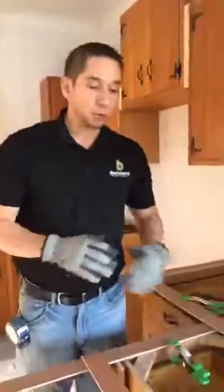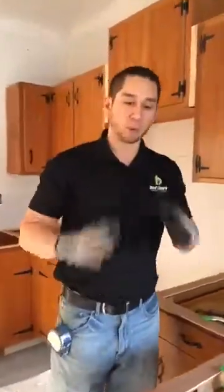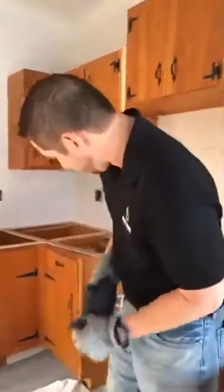Yes, Amy. Something that is very important that a lot of people don't realize is granite, quartz, soapstone, whatever the product is, it needs to lay on a flat surface. So you can probably see, especially on this side, where Brian, Amy's contractor, did a good job of raising the cabinets in instances like this because the floor was uneven.